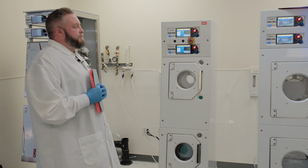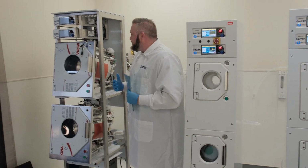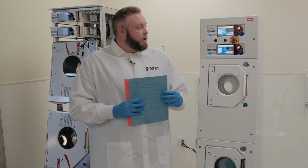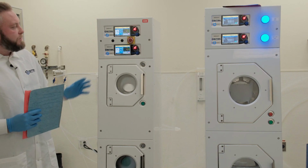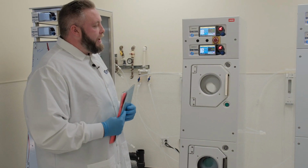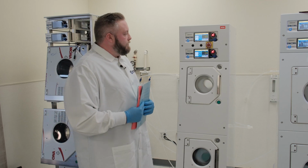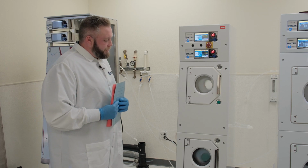And again, in the refurbishment process here at Sitek, you can see some of our options here. If we can just tilt it this way, you can send in just the chamber, where we will mount everything ourselves. Basically, you can either send in the chamber with no poly, whereas our customer here, we cleaned up and restructured, realigned all this poly on the outside. So either way, if it's easier for you just to pull the chamber out and send that in, you could do that, whereas you could also just send in the entire tool with the poly. We'll clean it up, realign it, and have it look in like new condition is our goal every time when the tool leaves our building. Got about 10 seconds left here in the dry tube phase.